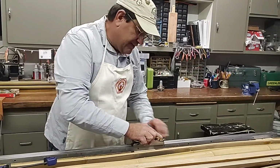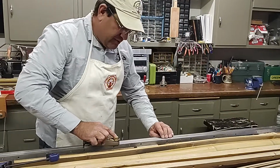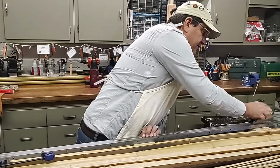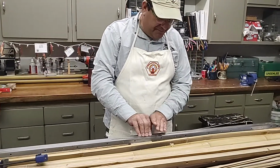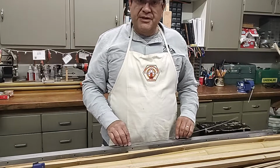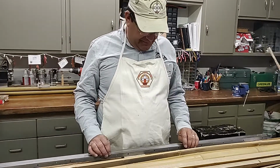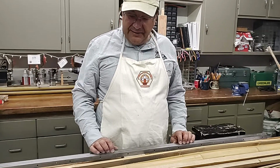And then once it's flat, then you would scrape it with either a scraping plane, or I like to use a razor blade just to get the final bamboo removed so that it's flush with the planing form. Then you'll do 6 of those strips, and each of those 6 strips will make a blank. And that's basically how we get to that.